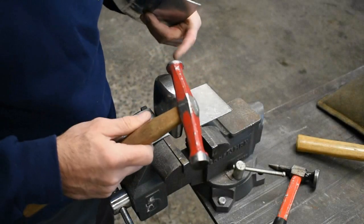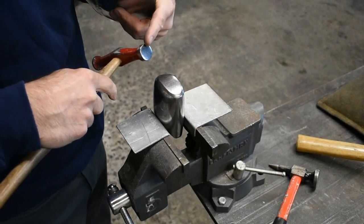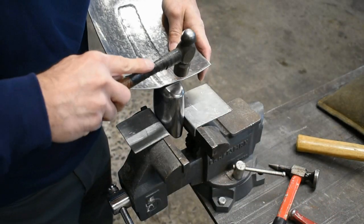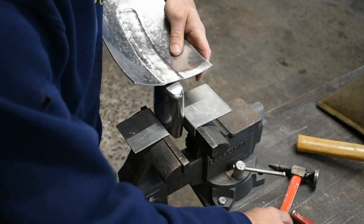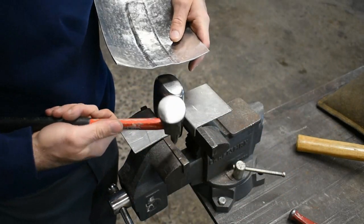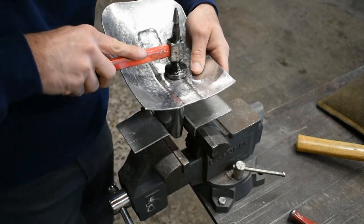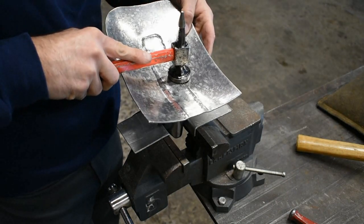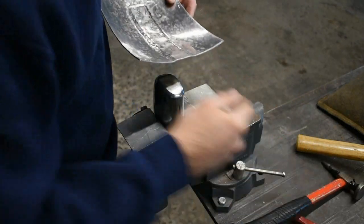Going to be continuing to use this hammer between the both sides. I need something, again, ball peen hammer might work for you here, but you just need something small, because if I use something with a big surface area, when I get to the curve, it's like the outside edges of the hammer will be hitting, but not the center, and that's no good.